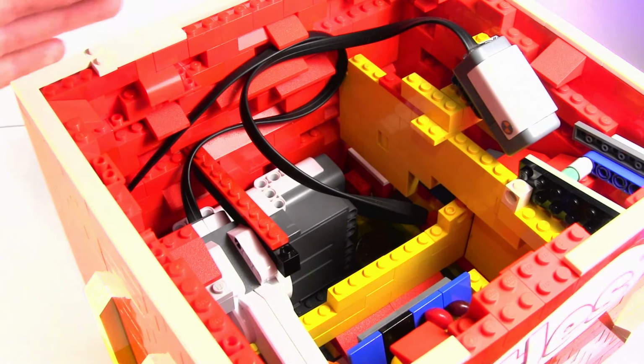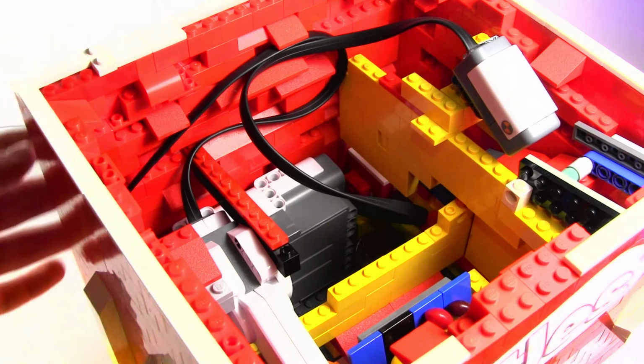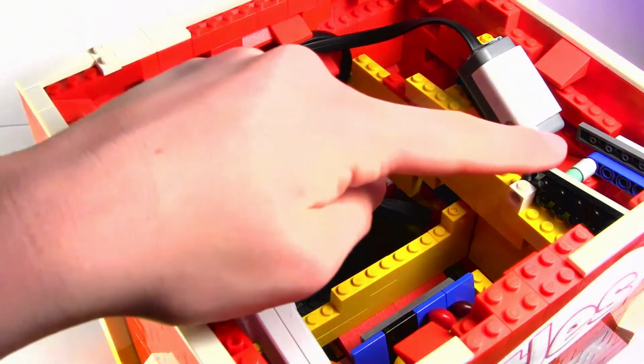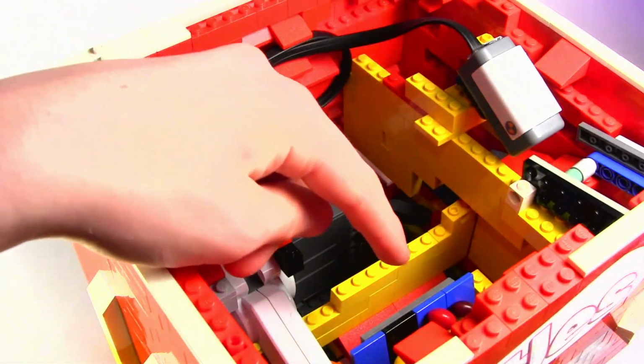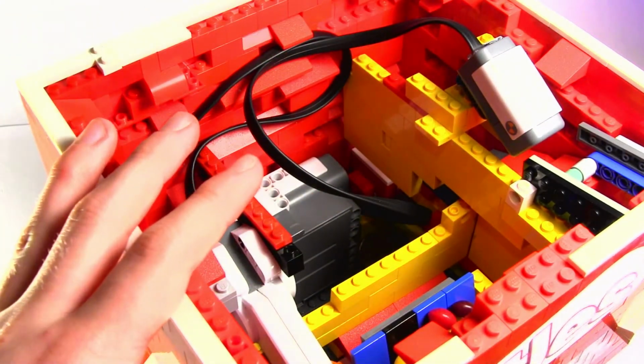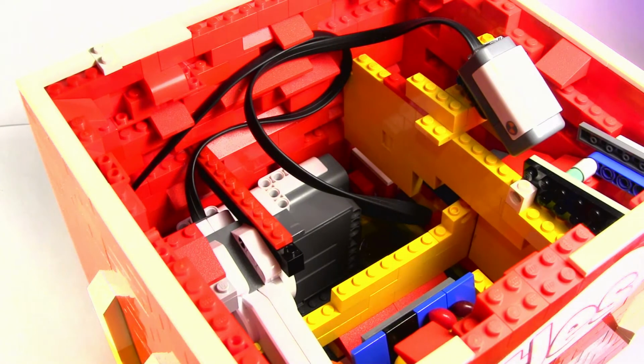So for those who are just starting, I would recommend when you are starting to build a machine, first think of the layout. One, having the coin rejection and also the sensor if you're doing a mechanism like mine or a dollar mechanism. For that dollar mechanism, you're especially going to want to pay attention to space because the dollars are pretty big and the whole area just to accept dollars is big, and then to drop whatever you're dropping depending on how big it is, it can be a problem to get everything to fit.